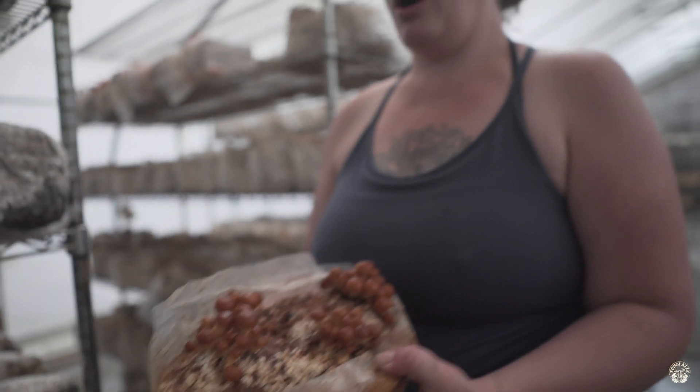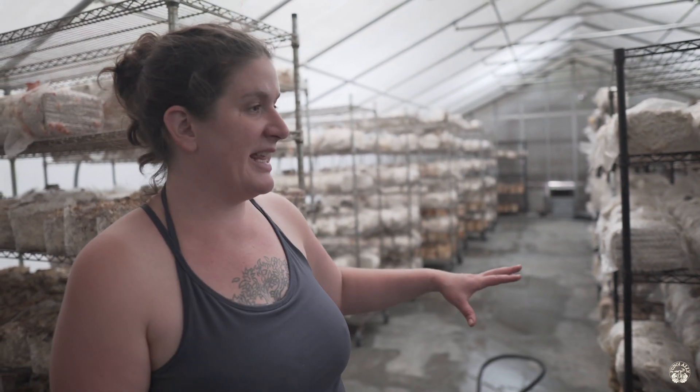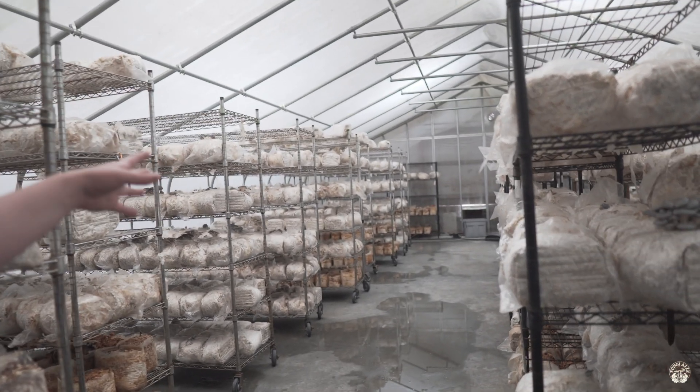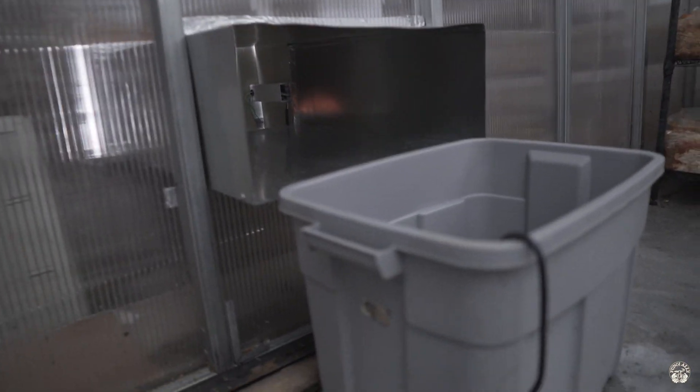We find it's a lot easier to keep our growing environments warm than to cool them down. In the winter these greenhouses are heated with radiant heat installed in the slabs — it's a nice, stable, diffused bottom-up heat source that maintains good humidity and a really nice growing environment. In the summer it's a lot harder to maintain a cool environment, but we've just installed some new evaporative coolers. There's the duct at the other end, and that has really helped us keep a cooler temperature, although we're still getting to know the system. For oysters, we bring in 600 to 700 blocks every week, and that means we're taking out about 600 to 700 blocks a week.